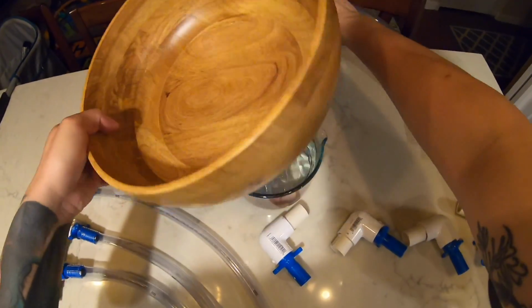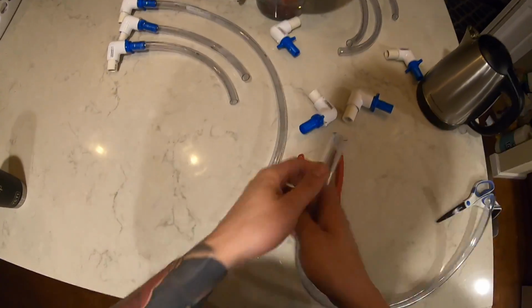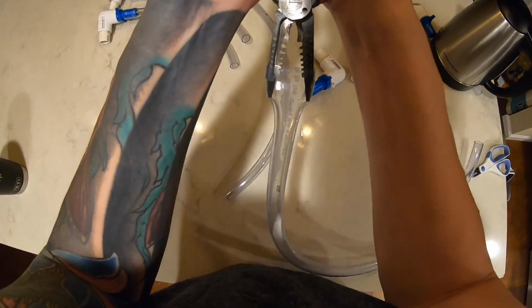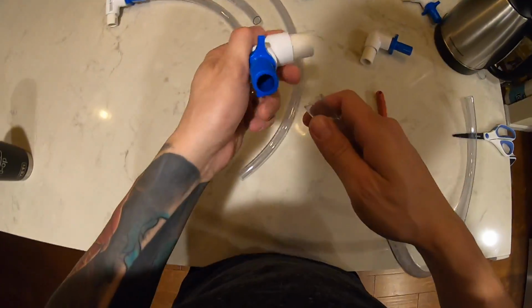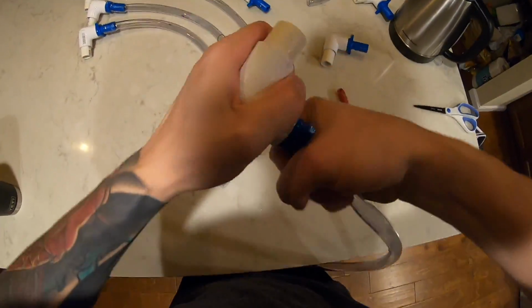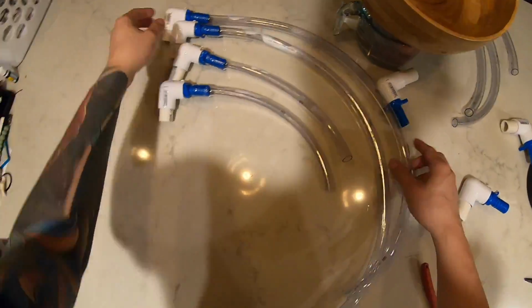The other thing you want to do is, the tubing is going to have a natural bend to it. You want to try to visualize, and that heavy salad bowl that's keeping those stupid tubes in the hot water, because that was getting a little annoying. But back to the tubing, you want to position it such that when you install that whole assembly on the bulkhead on the back of the tank, it's pointing in the general direction that you're going to drain out of, right?